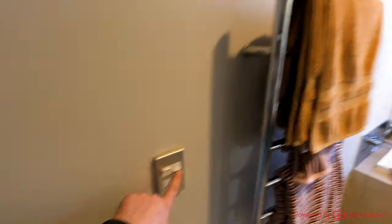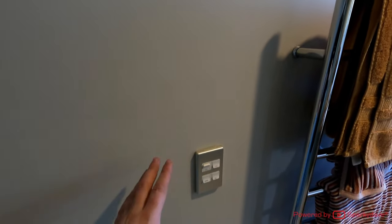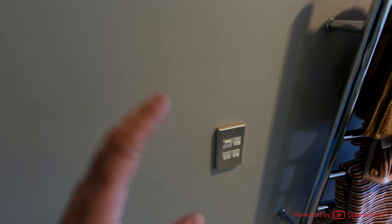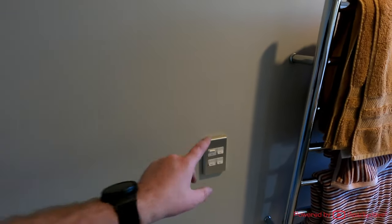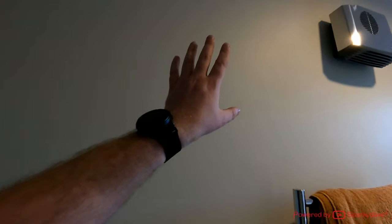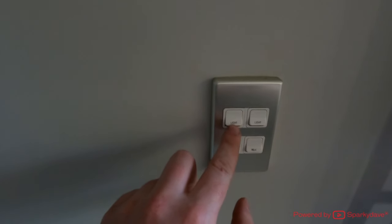The next part I'm going to focus on is ensuring that there's power up in the ceiling available for this fan to plug into. The first thing is to identify an appropriate circuit. Given these lights are independently switched, there's a good opportunity to use an existing cable for the center light and repurpose it for the fan, then connect all three lights on the same individual switch. I've already discussed this and got the go-ahead from the customer. Always ensure you discuss time-saving things like this with the customer; otherwise I would have to go through the process of bringing a cable down the wall, which may add a few hours to the job.